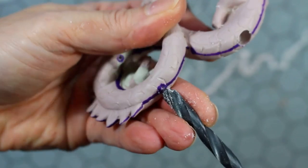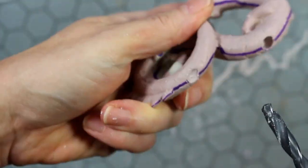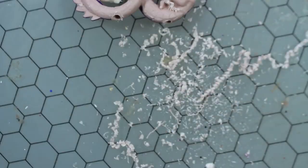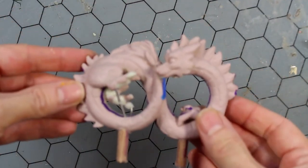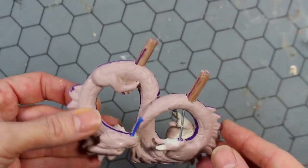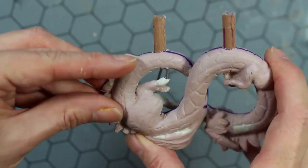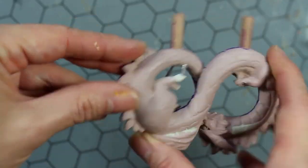One great thing about doing a junk cast like this, a waste cast, is you can figure out where your problem areas are. So all of these little holes now have vents, because I experienced air pockets in the master cast. So now I know where the vents need to go to prevent those air pockets in the final casts. And just these little wires, and the blue stick there is just a wax wire.